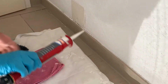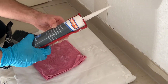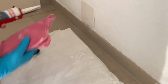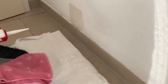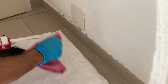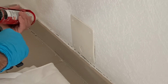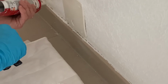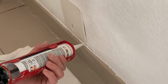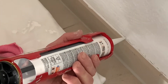Then you use a caulk gun and a tube of caulk, which is a mastic acrylic. So what I normally do, I have a wet cloth with me so that I can wipe the edge clean. Then I apply the caulk, not too much, otherwise you'll have a lot of leftover and you run out of it quickly and you're going to use a lot. So I caulk the crack